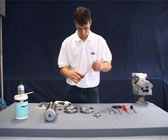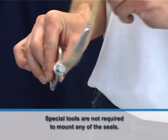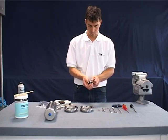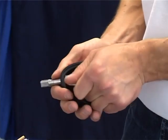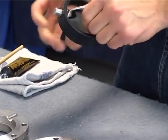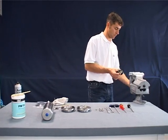Lubricate the upper and lower stem on the flap disc. When mounting the seat seal, first insert the long end of the disc shaft into the seat seal. Then press the seal together on the outside diameter and pull it over the short end of the disc shaft. The flap disc can be secured by clamping the square end of the shaft in a vise.